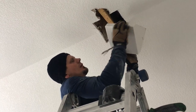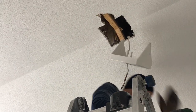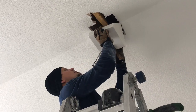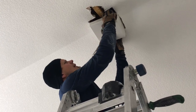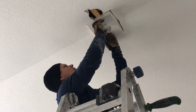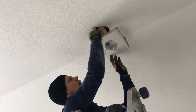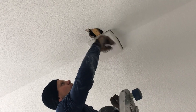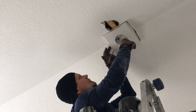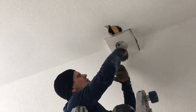So I ordered this box — I think it's made by Allied. We cut it out to be centered. I'm going to slip that in there and lag that. Then I'll just put a bead of caulk around that to make it nice and white and clean, and I have a guy I can refer that will patch that for him. This will give a dead center mount, and this is a nice lip here — gives us about a half inch all the way up to an inch and a quarter on the sides, so it's flush.